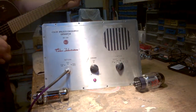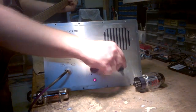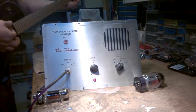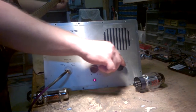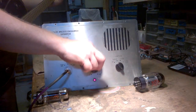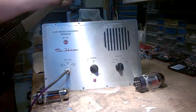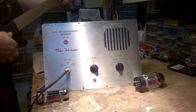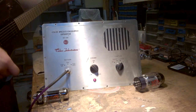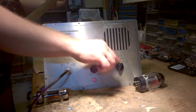I hope somebody can get some use out of this. For amp builders and experimenters — if you take a look at your schematic for your tube amp you'll be able to find your negative feedback circuit. Look for a line coming out of the output transformer being fed back into one of the preamp tubes. Usually there'll be a resistor in between these two. These kinds of mods are real easy to do if you're any good with soldering, and if you're not, it's not hard to get good at it — there are plenty of videos about that.